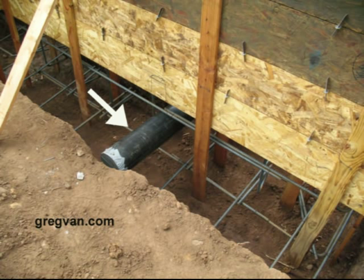But this pipe is actually in there for the plumber. Plumbers and electricians usually place pipes in the concrete footings for anything that they need to get on the other side of the foundation. Once this foundation is poured and they need to get their pipes in, you've got a problem. I can't tell you how many times I've had to remind someone to put a pipe in or ask someone whether they need a pipe or not in the foundation. So it's just hard to imagine sometimes.